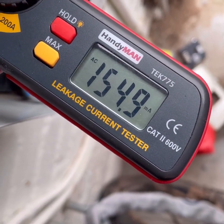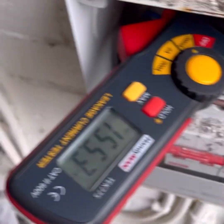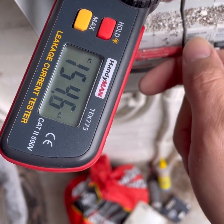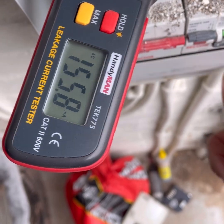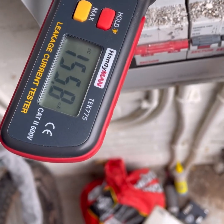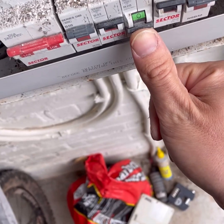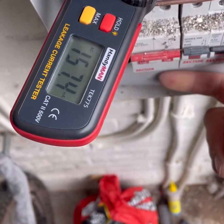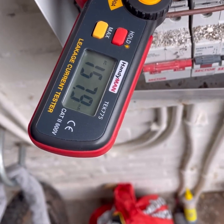I've got 154 milliamps on this consumer unit. Working through the breakers to find roughly where it is: the annex consumer unit and office above - nothing there. The consumer unit in that big adaptable box halfway up the garden, and the stables consumer unit - that's where the majority of it is: the stables consumer unit and these three sockets in this garage. Also electric gates on another circuit.